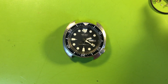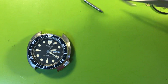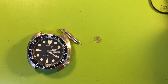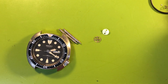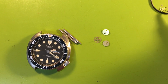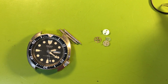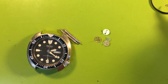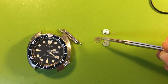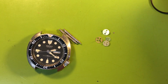That's a really nice thing to have. Like I said, your watch was incredibly worn. There are your spring bars, of course. But I can't remember the last time I had to replace all 4 wheels in the train. These had all this crazy lash, because their pinions are worn top to bottom, so the wheels are going up and down like this, which they should not have done. And not only that, I had to replace the bushing for the top of the 4th wheel, which sits in there like that. But that was worn. It's all abraded and gnarly.